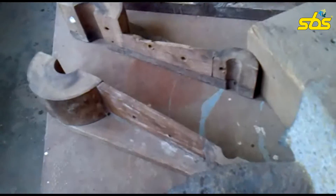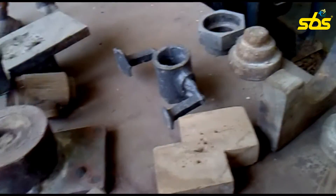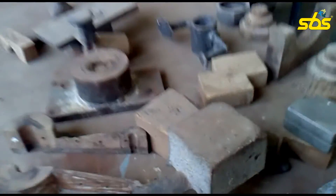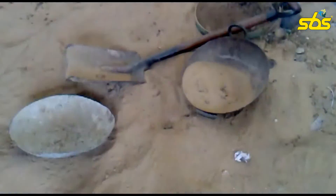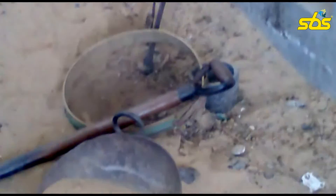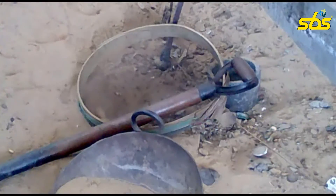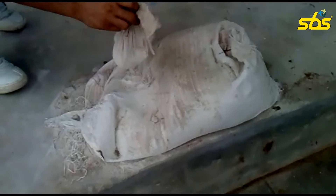These patterns are of wooden shape, and some are made of metal as well. The various instruments and machines of the foundry shop you can see. Here we can see a trowel and a pan, and just by the side there is a riddle placed over the raw sand that we have used as a raw material in our foundry shop. Now the parting sand in front of us that we are going to use.